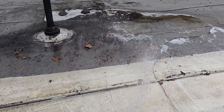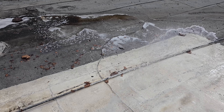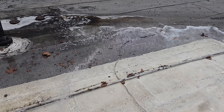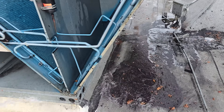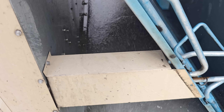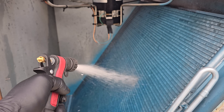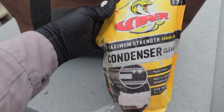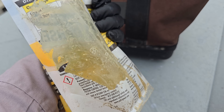I went downstairs and turned off the hot water because it served its purpose. We're using cold water now, just rinsing the coil cleaner off the roof so it doesn't damage anything down the drain, and then rinsing all the dirt and everything left over — because you don't want to leave dirt in here for it to get sucked back up. It's all about treating these things like they're your own.